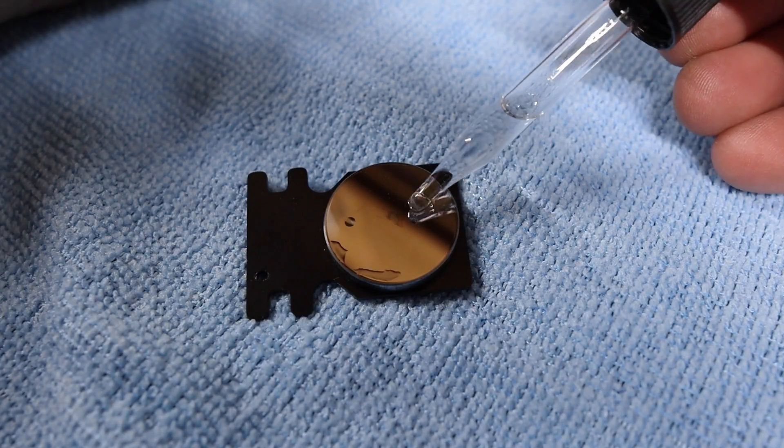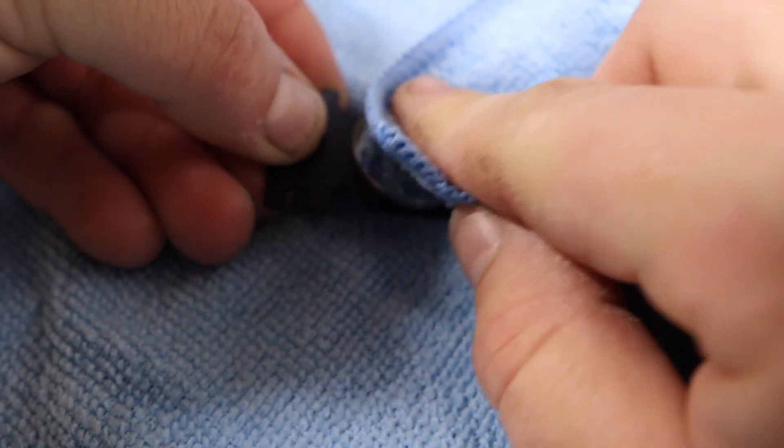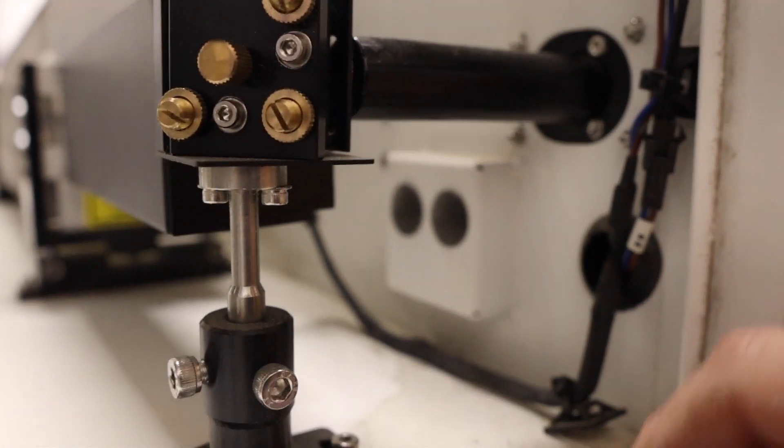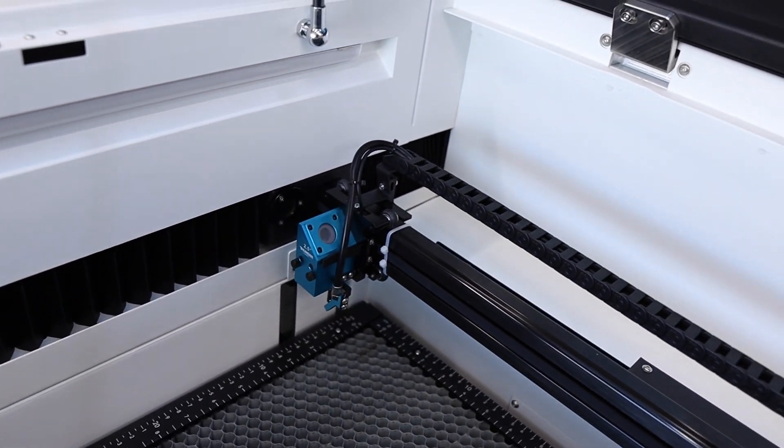This is definitely good practice, but I take a look at the mirrors in the light to see if there are any specks of debris, and if there are, I'll blow them off with a small duster. Then I use 99% isopropyl alcohol and a clean lint-free cloth to wipe down the mirrors gently — for me, this works well. The single-screw mirror removal is super convenient and really makes it easy since you don't have to worry about mirror alignment after removing them. I also love how mirrors 1 and 2 are enclosed from the laser work area, which helps keep them clean by limiting exposure to debris and smoke.